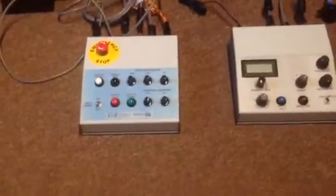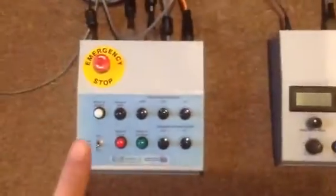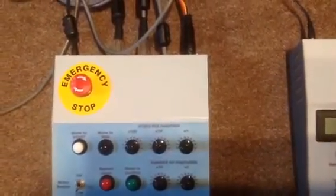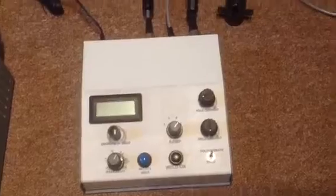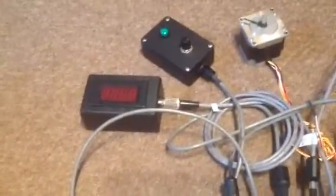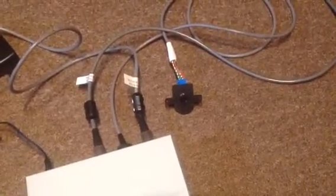I'm recording this for my own reference. This is the welding machine I've made. That's the motor controller on the left, which has various settings: steps per position, number of positions, move to start, move to end, and so on. There's also the controller that manages weld current and switches on and off when an encoder decides it should, plus a counter to track the number of positions welded, a jog handset, a stepper motor for indexing to position, and an optical shaft encoder.